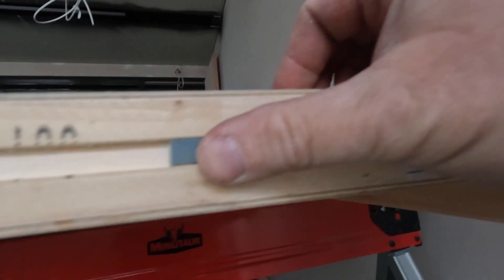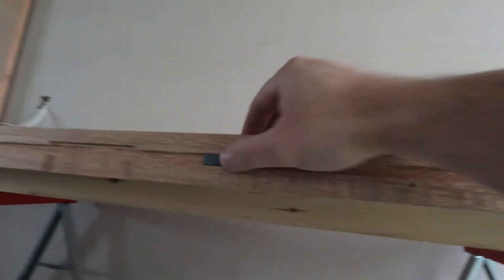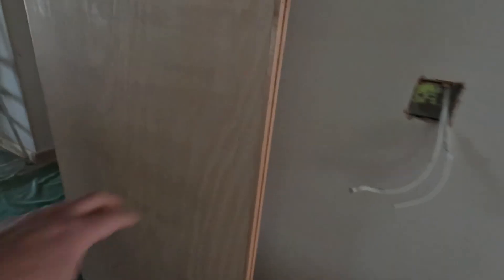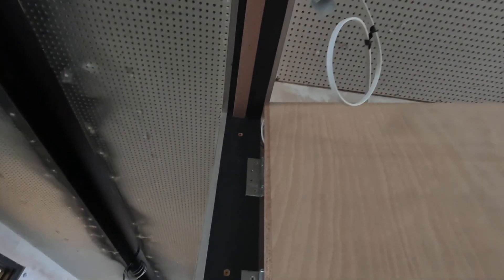We are not going to install the fire strips now because the doors need to be painted first. We'll check the channel with a 4mm packer just to make sure the strip will be flush with the door. It's very difficult to mask these strips because they have a brush, so ideally you want to put them in after the door's been painted. I installed two hinges at the top, one in the middle, and one at the bottom. I prefer to double up the hinges at the top with heavy and tall doors because in my experience the top hinge tends to fail first.